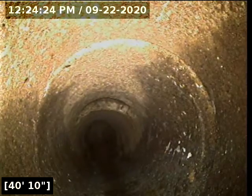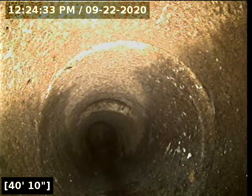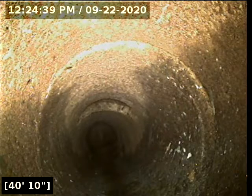A lot of times that transition to 6-inch pipe is, in Portland anyway, almost always at the transfer of responsibility to the city, which is usually at the street curb. Now with newer stuff, it's usually at the sidewalk edge rather than the curb. But yeah, I'm going to try and locate this.